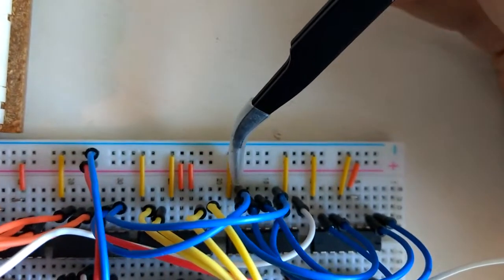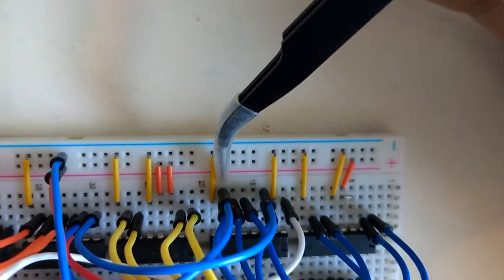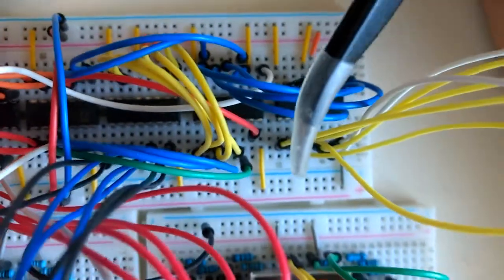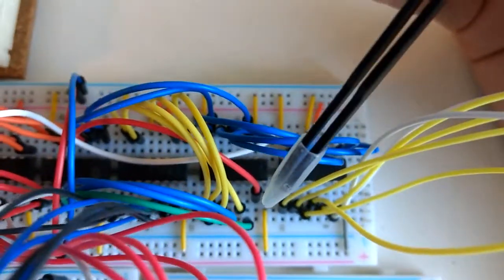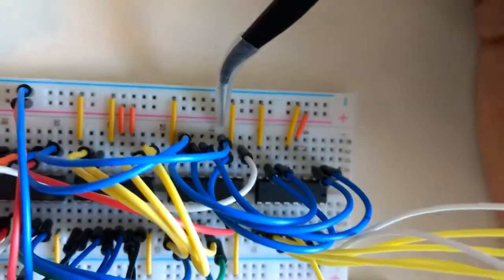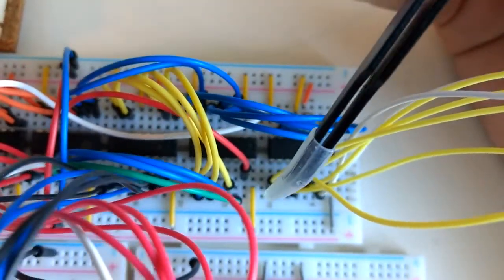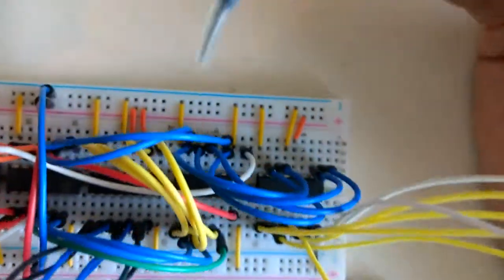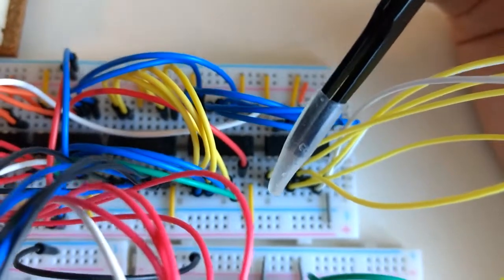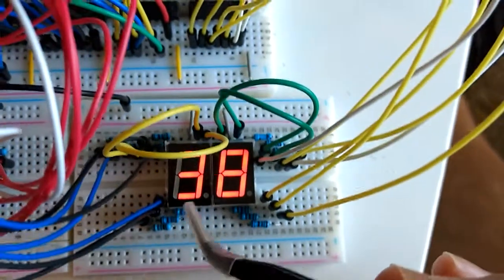The number 9 in binary is 1001, so we look for the first and last bit to go high. Those run into the AND gate, and the red wire comes out as the result. When we reach 9 these bits go high, so the clock pulse goes high. Nothing happens yet — it isn't until we loop back from 9 to 0 that these go to 0, the red wire goes to 0, triggering a falling edge which is used as the clock pulse for the second counter, causing it to increment.